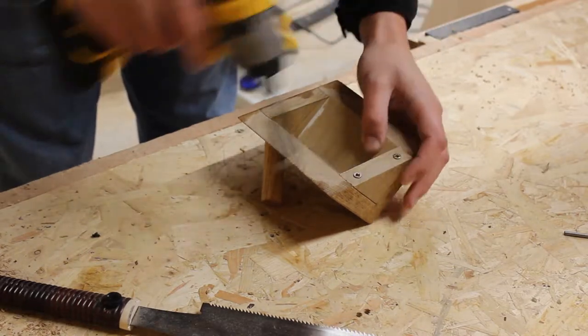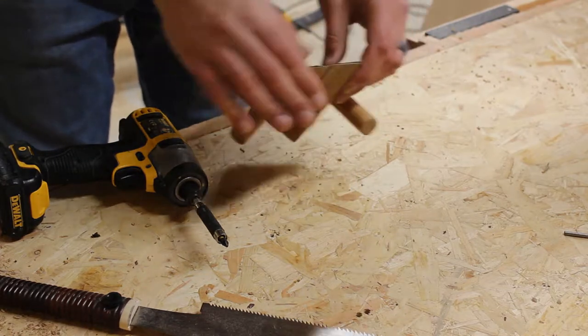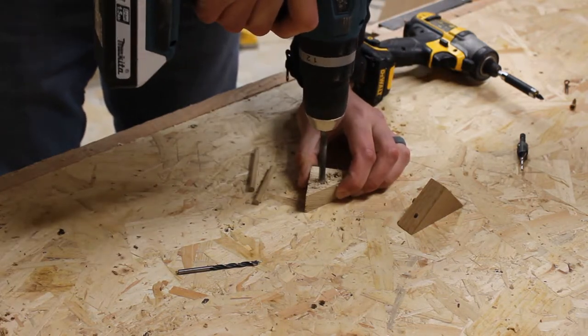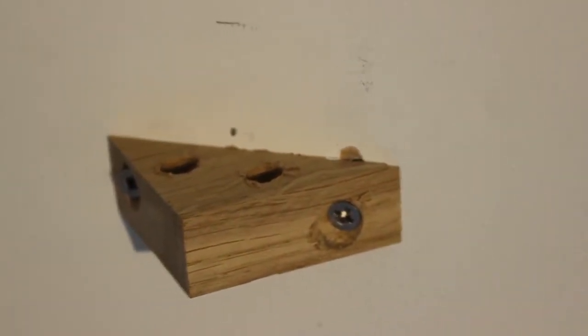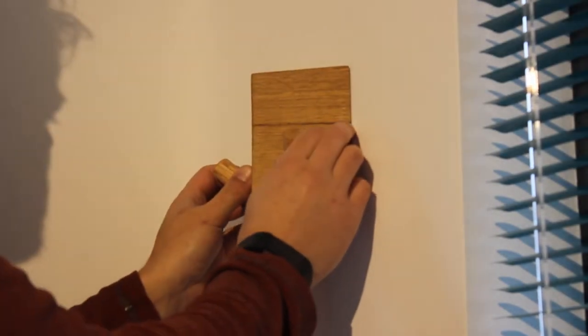They won't be seen of course once the coat rack is mounted on the wall. However, first I inserted some 10mm oak dowels to the underside. With the third triangle, I drilled some 10mm holes in the same place as the oak dowels in the other piece — you want these holes to be slightly deeper so the dowels can be fully inserted. This piece attaches to the wall as a mounting bracket and the coat rack slots on top, the oak dowels from the top piece creating a nice snug fit.